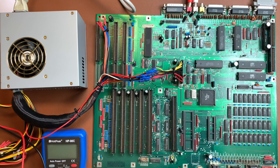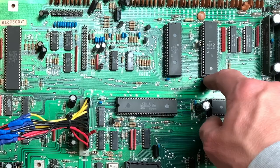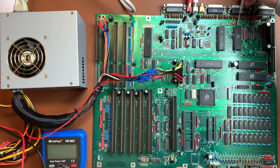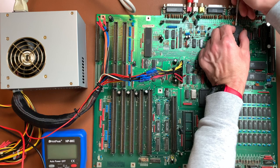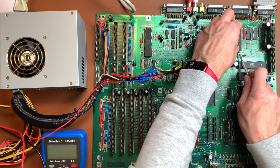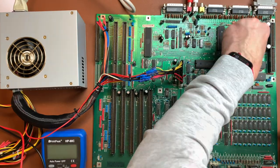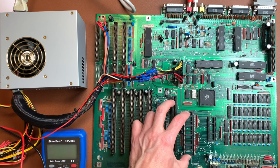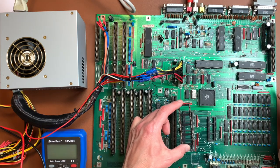You might have been screaming at the screen the whole time — I didn't see it, but look at this chip: two legs appear to be missing, though they're not actually missing. That IC just isn't seated correctly. Let's check if it's even the right IC in that socket — it looks like someone hastily populated these chips. I'll replace the corroded socket first, and if the machine still doesn't boot I'll test all the chips in a known-good machine.